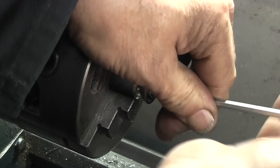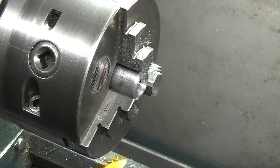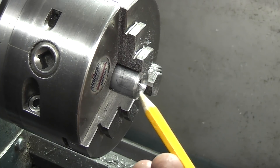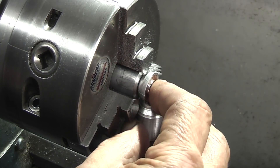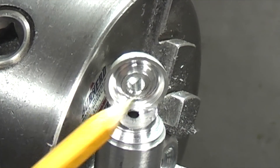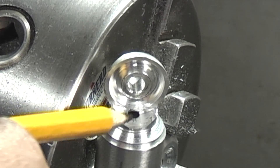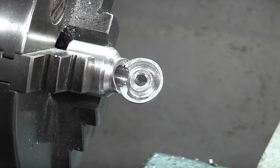Right, you can see how this is held. The chuck on the lathe — just put an aluminium bar, machined and tapped a 5mm hole in the end, then just put a recess so that it locates on the dome, bolted it in with the cap head, and then made sure that the edge just touched the jaw so that it won't spin. You can see there the hole coming through for the cable, which needs to be a little bit deeper so that it breaks into this recess. You can see now I've opened the hole up and it comes into the groove I've just machined, so the wires can travel around the centre.